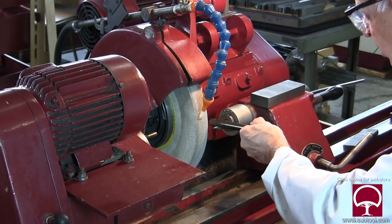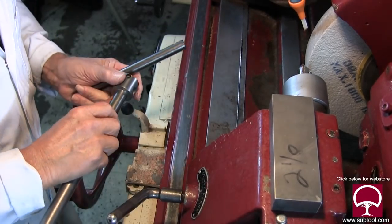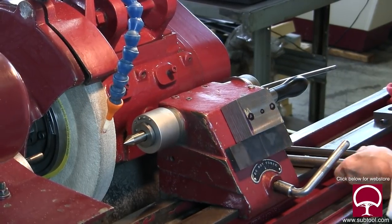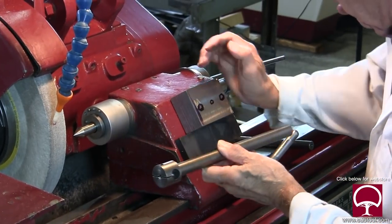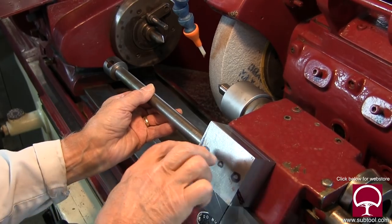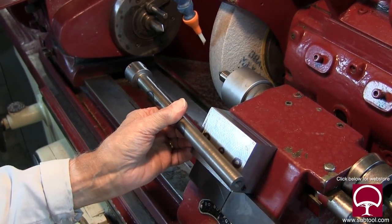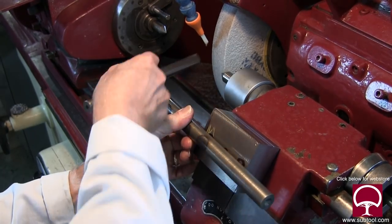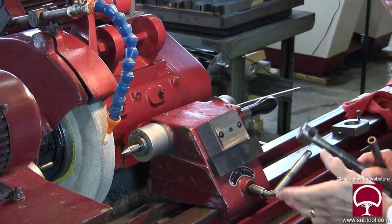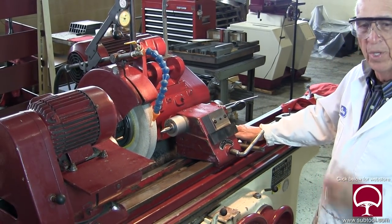The idea here is to put the diamond in the end, and we would rest it on the center. We're going to have a shaft that slips in and allows us to go in and out. We're going to put a block on here and bore a hole through it — there's a magnet there just to hold it temporarily for positioning. We'll put a couple of cap screws in there, drill into the tailstock, and mount that block. That allows us to move the shaft in and out. So if we're grinding a one-inch part, we can set it up within a turn or two rather than cranking it 50 or 60 turns.